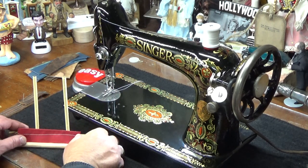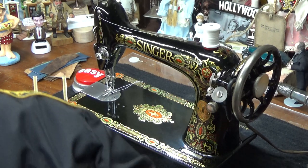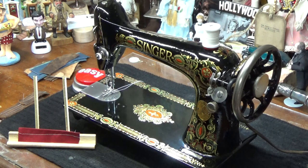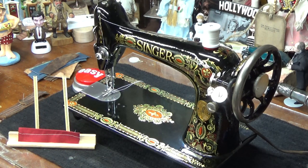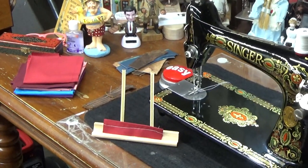And so right now our top stitch is weak looking. I'm going to make a correction after I zoom in to show you guys to resolve that. That's what happens when you go between a wide field of stitches and materials: you can get a weaker top stitch than you want. I'm zoomed in on it real close right now, and later Barb will be able to see this as well. So we've got clearly a defined stitch, but it's underemphasized.